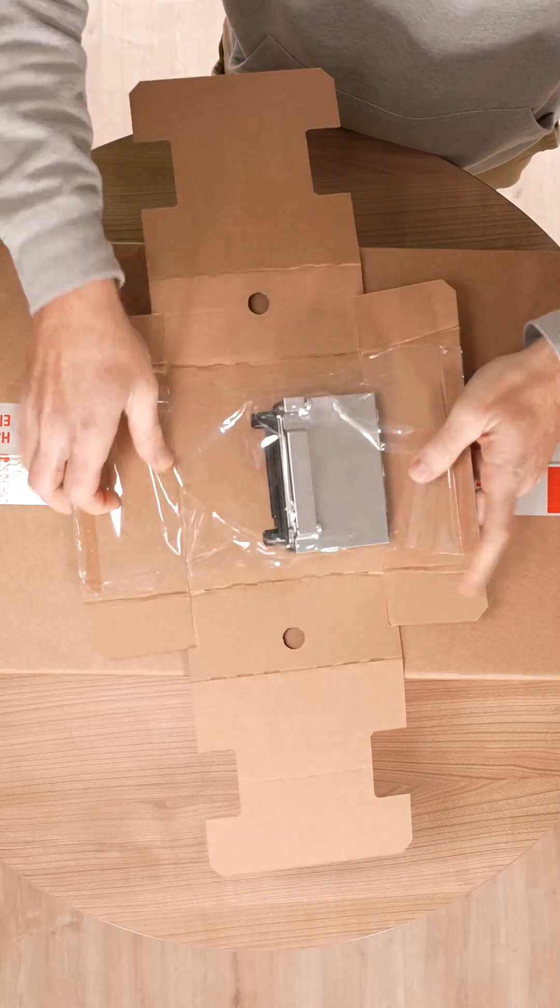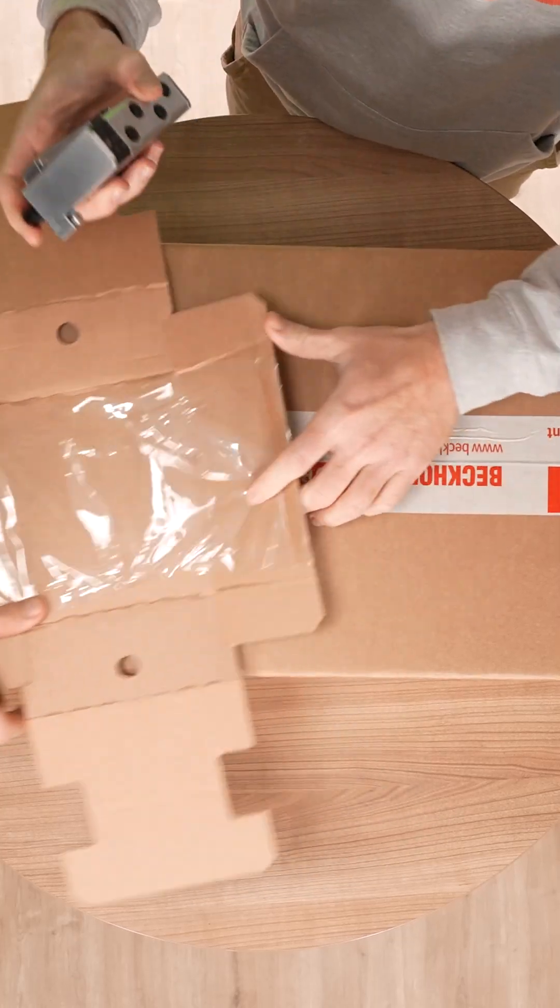What I can see is that's a module for the new MX system. Can you give us an idea what it is exactly? This is an EtherCAT power output, so we have two channels each with two M12 connectors. One is for EtherCAT and one is for 24 volts, while we have one pin that's switchable and one pin that's not switchable.